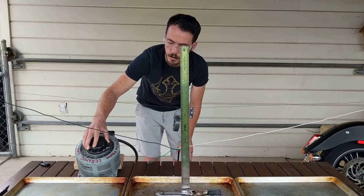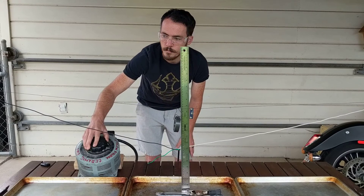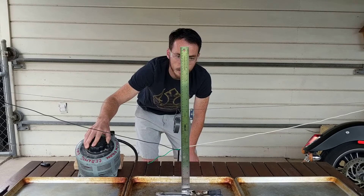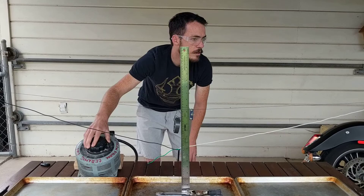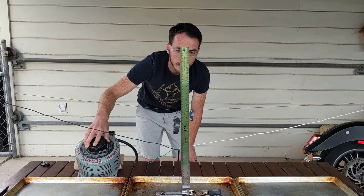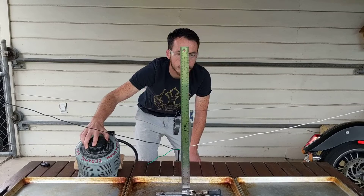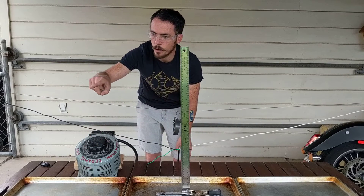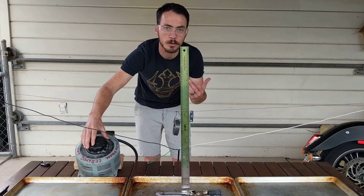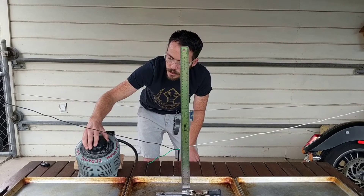Getting lower and lower. We want to be careful here — we don't want to melt the wire. We keep getting hotter until it starts to glow a little bit. We're at 30% right now. We're up to 33%, 35%. The wire is starting to turn a little bit orange. When it gets hot enough, around 700 Celsius, it starts to change color. What we're seeing is the radiation coming off — it's called blackbody radiation.